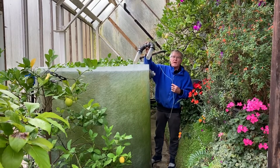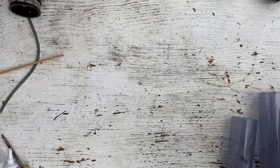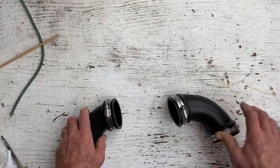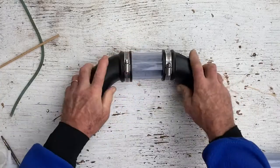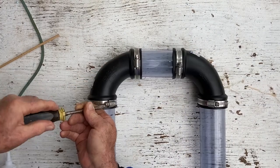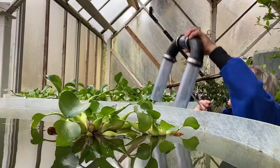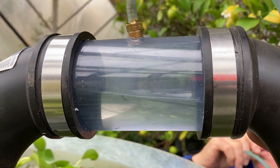The tube allows you to remove the air, because it has to be full of water to work with no air bubbles. To make the siphon, I cut three pieces of clear PVC pipe. The PVC pieces are attached to each other with flexible black plumbing fittings that are tightened with cable clamps, and the clamps are tightened until the siphon is airtight and watertight. When you put it into a fish pond it's initially full of air and doesn't work.